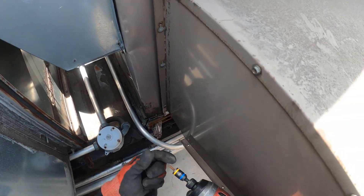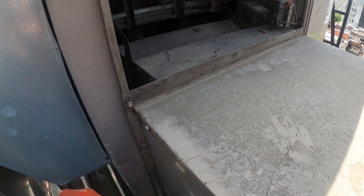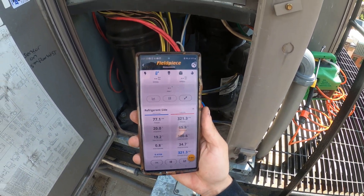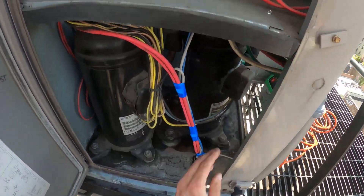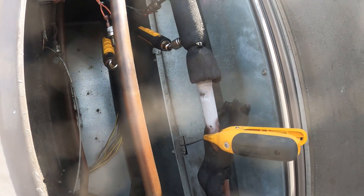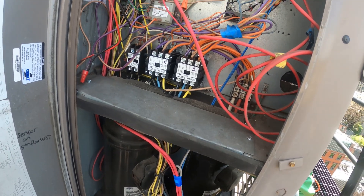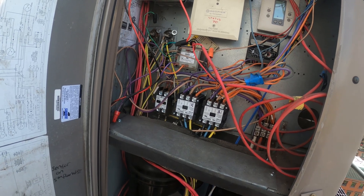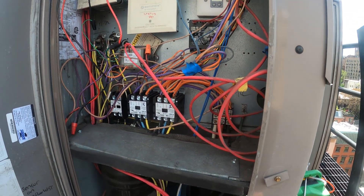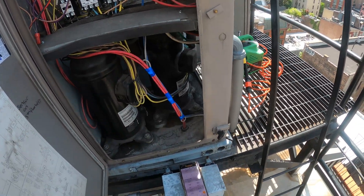Let's start it up and see what's going on. Pretty sure we need other repairs here, but we have to start with at least a cleaning of the machine, then we can get a better understanding. We just started this unit and our back pressure went up 20 pounds — that's a big deal. But I can still see the compressor is freezing up a bit, partially at the suction line. So wherever it's not insulated, it's freezing up. That coil was definitely plugged up, but we have further issues: we have a very high subcooling. It could be that this is overcharged — maybe somebody came in here, saw the low pressure, and added refrigerant, but that didn't fix it. I would definitely want to weigh this in, so there's definitely going to be another follow-up.